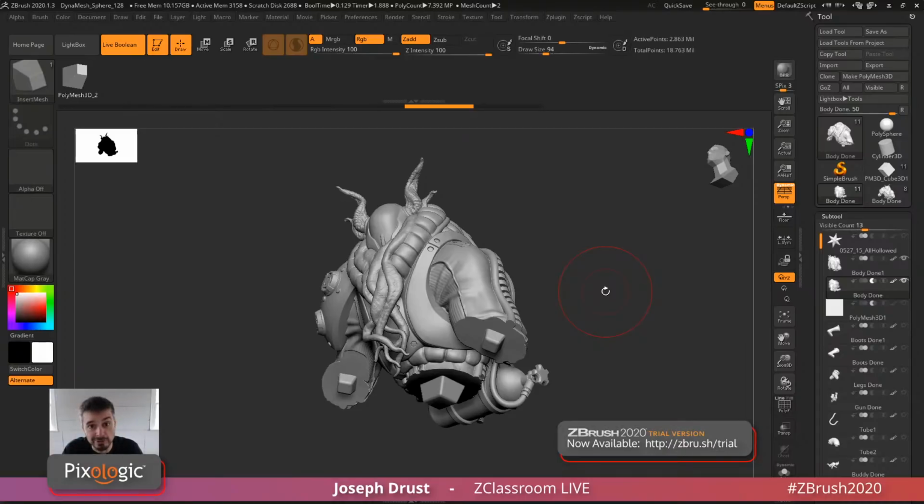And for that stuff too, don't ignore it, because it will give you a line on your print. You may think it's not gonna be bad, but the problem is that it creates a suction, and then when it goes to wipe, it shifts the print. And so if it shifts the print, your next layer is gonna be offset a little bit because the suction was too strong to break it from the thing. And so definitely, if you ever get a suction error, fix it. If not, you're gonna have a print and it's gonna have a clear line where that suction problem happened.